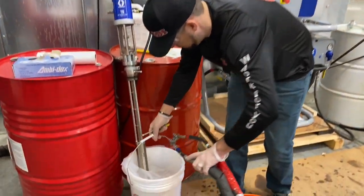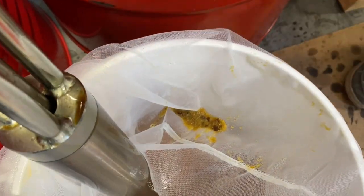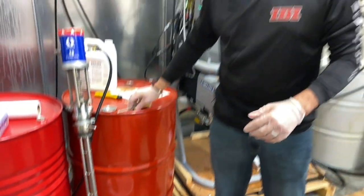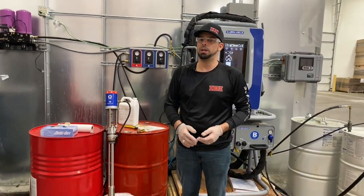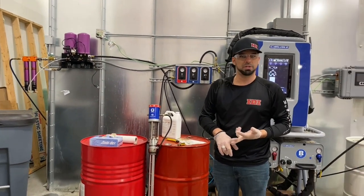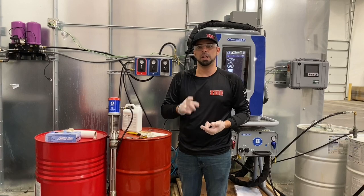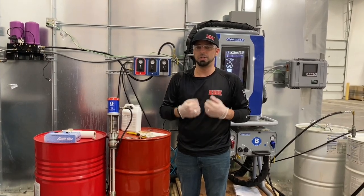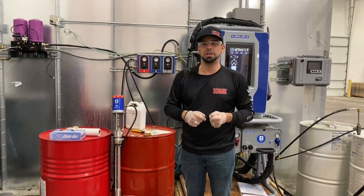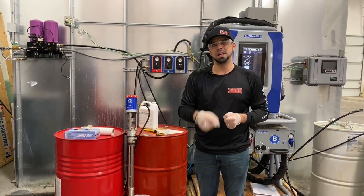As you can see, we got quite a bit out of there. Just think — if we hadn't flushed that out, all of that would have gone directly into our Y strainer screens, into our gun, and it would have created so much downtime on site when we're supposed to be there making money. The main thing is never let that A-side sit. If it does sit for too long, make sure you flush it correctly and use those GSP products that you can get from any one of us here at IDI. If you have any questions about anything we've talked about in this video, please don't hesitate to reach out and give us a call. Like and share this video — TJ Miller with IDI, thanks for watching.